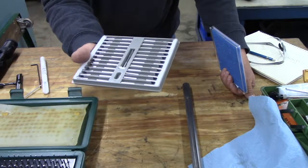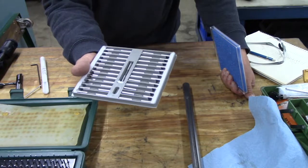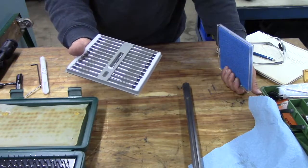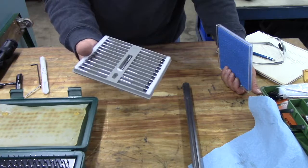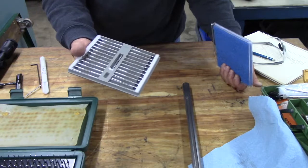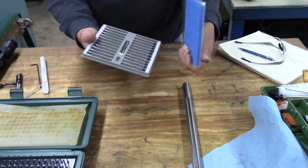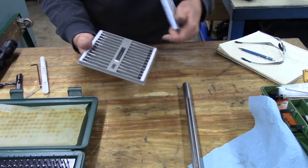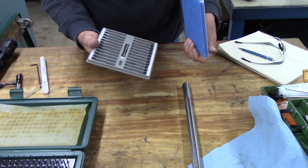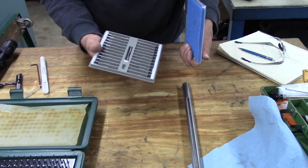If you get a set of these and start sliding them down, do so carefully. Acute angle taper locks are incredibly powerful, and if you get one of these hardened steel pins stuck in your barrel, you're going to experience a whole other level of pucker factor trying to get it back out. So as I push these through the barrel with my cleaning rod, I go very slowly and very lightly, and if I run into any resistance at all, I stop and back out.